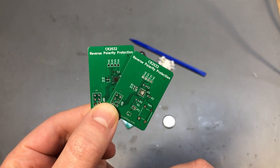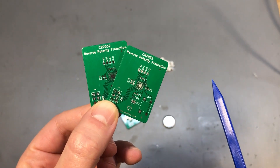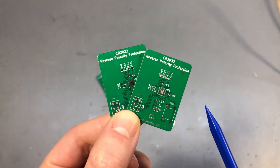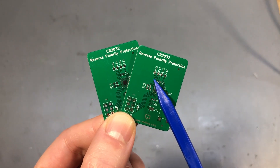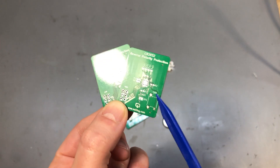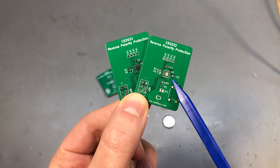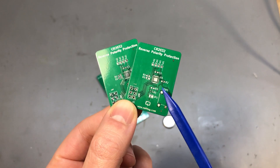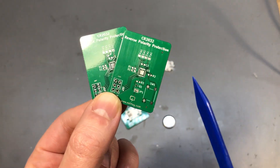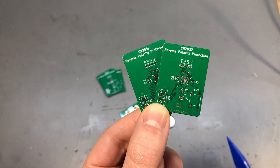And just a quick side note here: when I design small boards like these to explain a circuit or to prototype something without having a final use, I try to bring out some test points, because it has happened to me more than once that at some point I need to prototype a different circuit — a new idea based on the same chip or a similar chip in the same package. So I just grab one of these old boards from my stash and I'm good to go. It's always a good idea to bring out a few test points and IOs that might be useful in a future project.